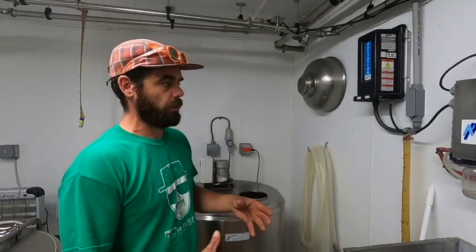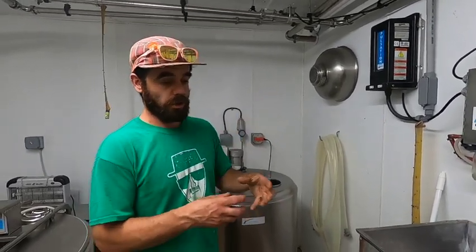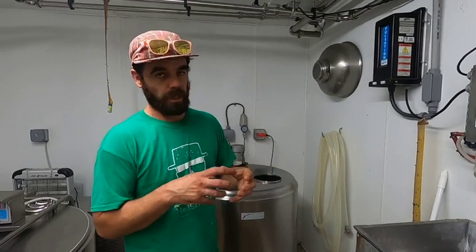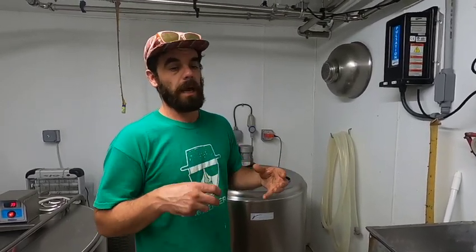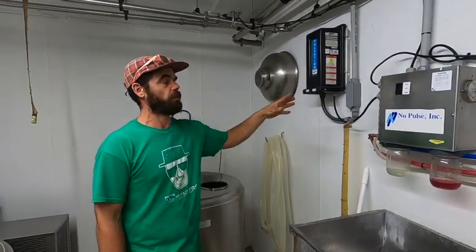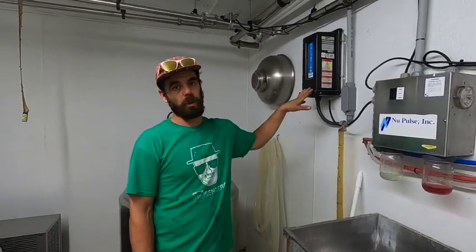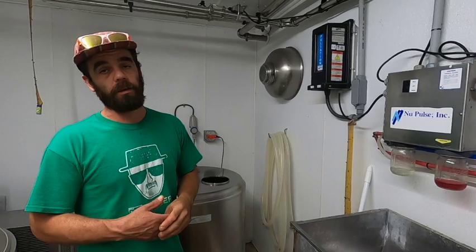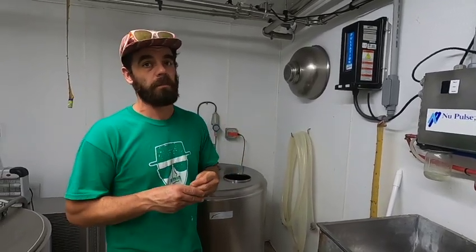In the other video, the pulsation mechanism, which I'll show you a little later in this video, you'll see that it's electronically moving, where bulk vacuum is actually making it happen in the old setup. This is more fail-safe. It's always going to pulse at what you want it to pulse, no matter what vacuum is going to it. But it still needs vacuum. You're just electronically pulsing the vacuum instead of the vacuum creating the vacuum pulsation.